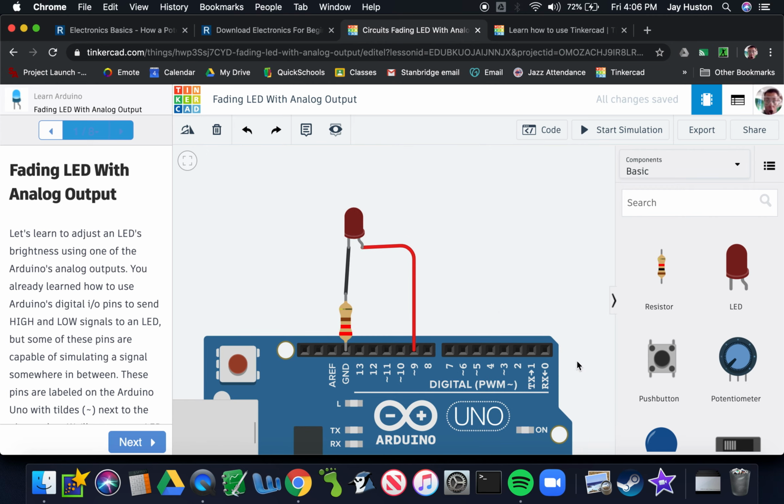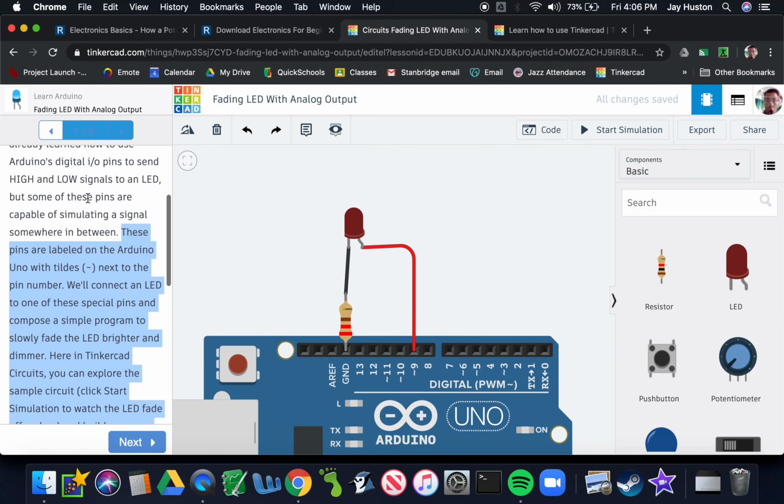And if we look at these pins, we notice that 0, 1, and 2, and then when we get to 3, there's a tilde. Tilde is this shape right here. There's a tilde only with certain pins. So 3 has the tilde, 5 and 6 have tildes, and then 9 through 11 have tildes. And that has to do with the pulse width modulation. What? The PWM. Well, that didn't help either. We'll find out about that for a bit.